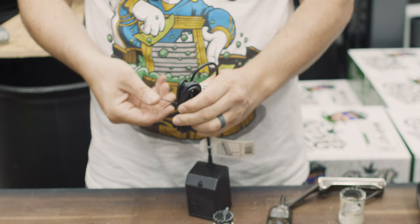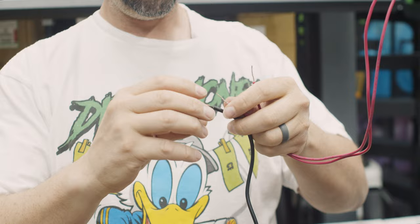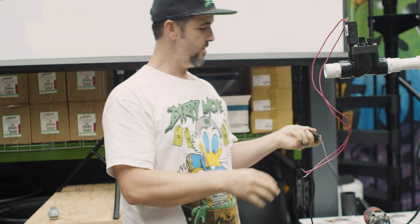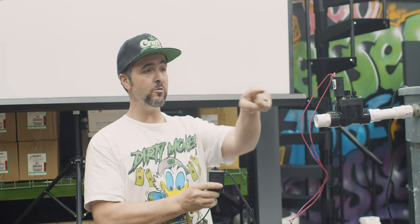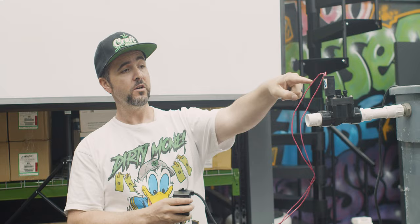This is our transformer. It takes a 120-volt signal and turns it into a 24-volt signal to control our irrigation valve — it doesn't matter what size you connect it to. I'll put some electrical tape around these connections, then this plugs into your outlet and this plugs into there. When the float inside your tank is down and needs to fill, it allows power to pass through, which gives the transformer power, opens the valve, and fills the tank. As soon as the float raises and stops it, it shuts power off to the transformer and closes the irrigation valve.